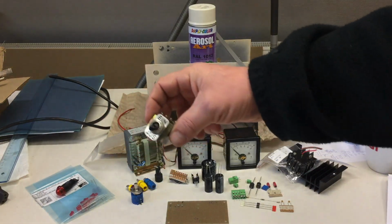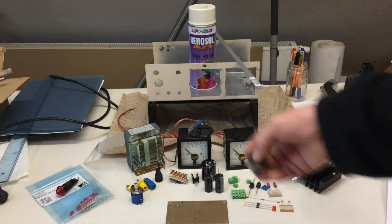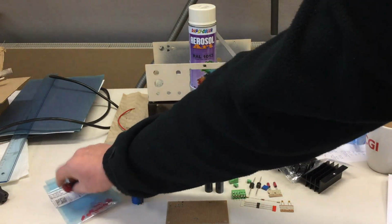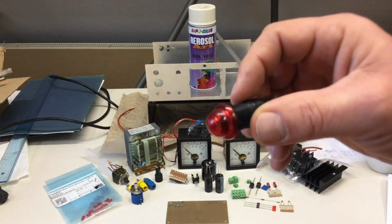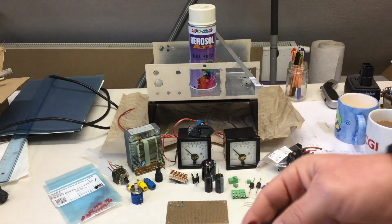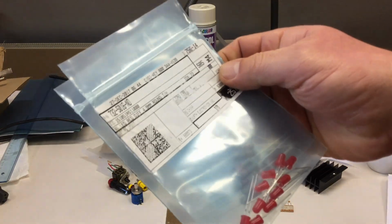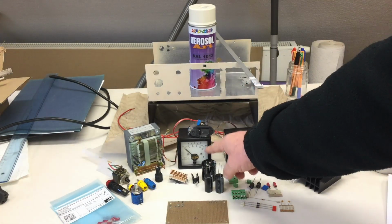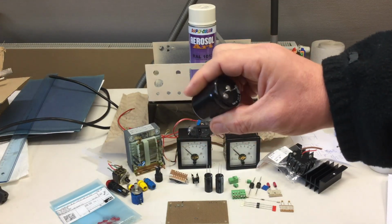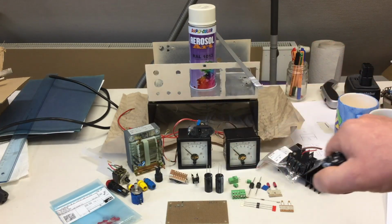I will keep the main power switch. Why not? It's a really sturdy old school switch. I like it. And in the front there comes a fitting indicator light, with some 3 LEDs and fitting resistors for them, just to put some basic load on my main power rail, because otherwise the voltage doubler will blow up the main filter cap and probably even more.